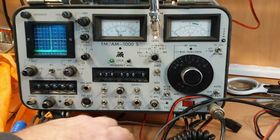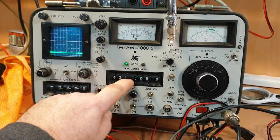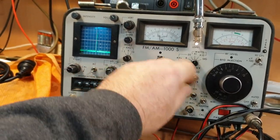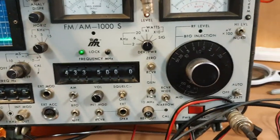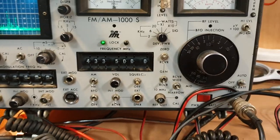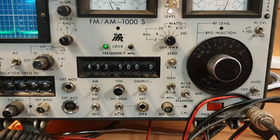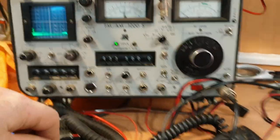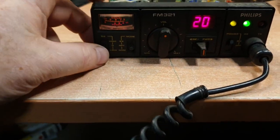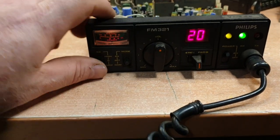As another illustration, let's go back to 433 on the input. Doing an audio test - 1, 2, 1, 2 - that's sounding quite like it's deviating and doing what it should be doing - 4 to 5 kilohertz deviation. So for all intents and purposes, everything on this radio looks good: good receiver, transmitter 5 watts, deviation correct. But we've got an issue with audio.